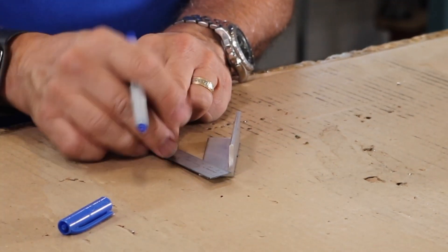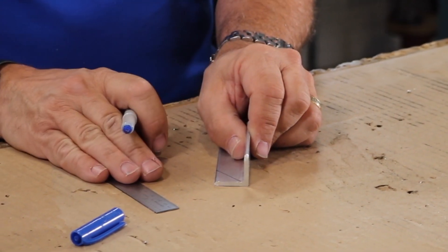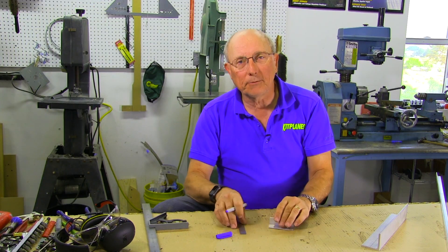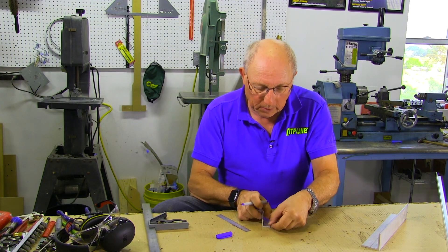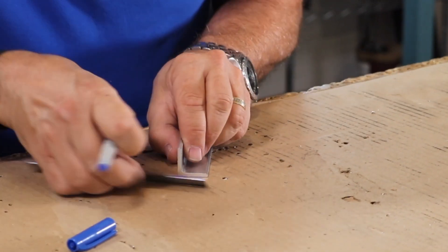One way to handle the difficult 45-degree cut is to not cut it at a full 45 on the bandsaw, and then use the grinding wheel to bring it down all the way to a 45 later. That's just a complicated problem. Let's do something a little simpler — let's say we just want to put a 45-degree angle from about the halfway point. That's easier.